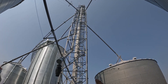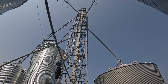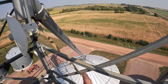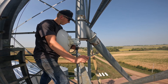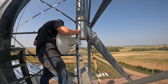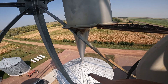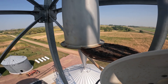The only thing left to check is the K-valve on the leg that fills our 42-foot bin. The reason for this K-valve is since this bin is so short, the grain has to travel a long way to the bin, and this slows down the grain flow so we won't have any cracked kernels inside the bin. I've learned my lesson — if you don't clean this out, you get rotten corn that sticks inside and will actually plug up the pipe down to the bin, which slugs the leg, and that's not a fun day. Got it cleaned out, just need to put that cover on and this thing will be ready to roll.